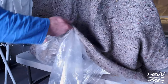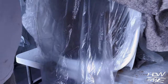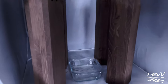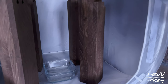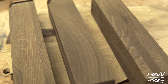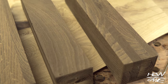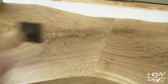So my thinking here is basically, you've got a piece of furniture, it's going to get dinged somehow, possibly with a vacuum cleaner. If you've stained a piece of legs with, say, Indian ink, it's only penetrated like a millimetre deep. And you're going to start to see the colour of the wood showing through. It'll be grinning at you like a Chinese cat. With this, it won't. I mean, you can see the bottom of the legs, which are actually what they're standing up on. That's penetrated that deep. I'd say it penetrates about 6 mil deep.